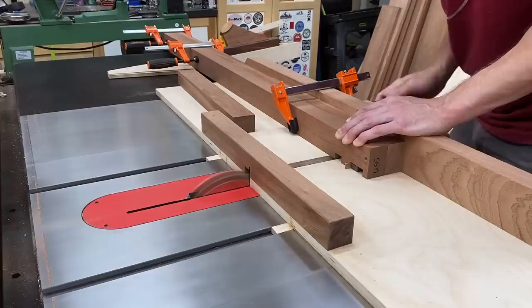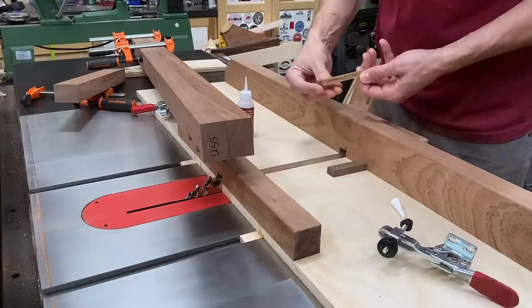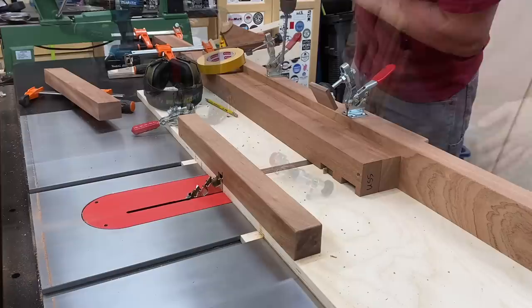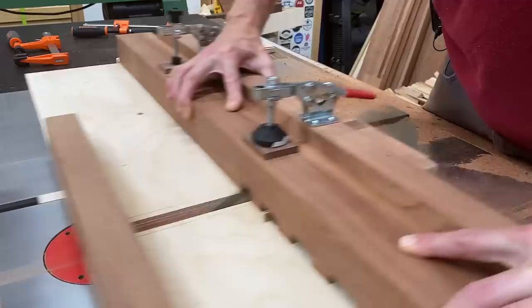After my first groove was cut, I made my first pass on my second, then I took that shim we discussed earlier and slid it in and made a second pass. I hadn't affixed that shim yet because I wanted to make sure the cuts were going to be consistent. With the fit confirmed I could CA glue that shim to my stop block. Rather than using an F-style clamp and clamping and unclamping every time I moved it down, I installed these Bessey hold-down clamps, which work perfectly and also secure any bowed boards down perfectly flat on the sled.